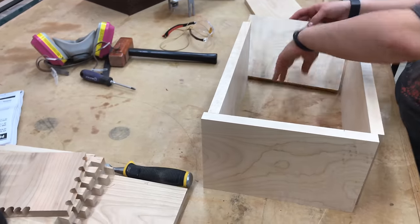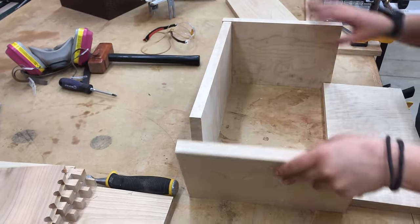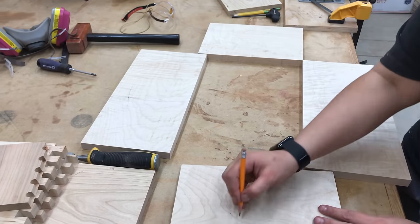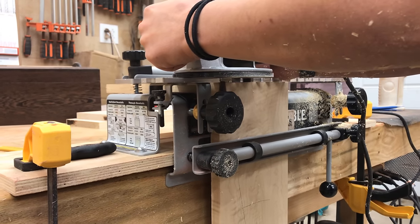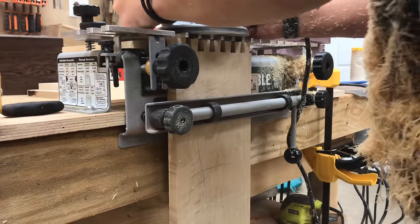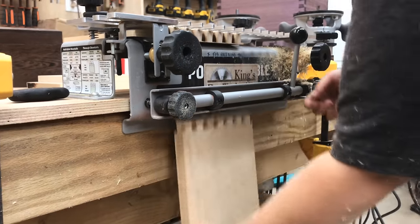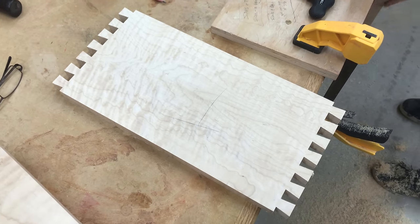The first thing we like to do is set up our box in the orientation that we want to see it in. We'll pick and choose the faces of wood that we like to be out. Then we'll lay all the pieces out in exploded fashion and write which boards we choose to be the tail boards and which boards we choose to be the pin boards. Then we'll set up our dovetail jig and begin to cut out our dovetails. I do have a video dedicated to making through dovetails that shows you every single step from start to finish so that even someone with no experience can make a perfect dovetail on their first try, and I will put a link to that video in the description.